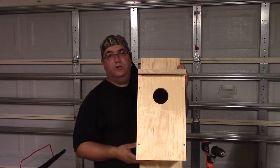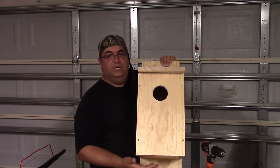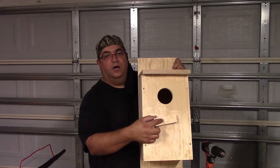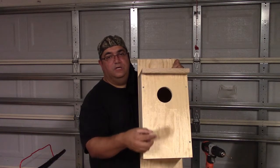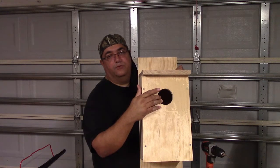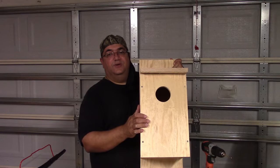That's it for my video — I hope you found it helpful. If you did, hit that thumbs up and subscribe because I'm always uploading new videos. This is your screech owl house, ready to be hung. You can put the perch on the outside — glue it or screw it with a quarter-inch screw so you don't pierce through the panel — or place it on the inside so baby birds have something to grab onto. Make sure your entrance hole is three inches in diameter; anything smaller and the bird won't get in. Have fun attracting screech owls to your backyard — see you next time!